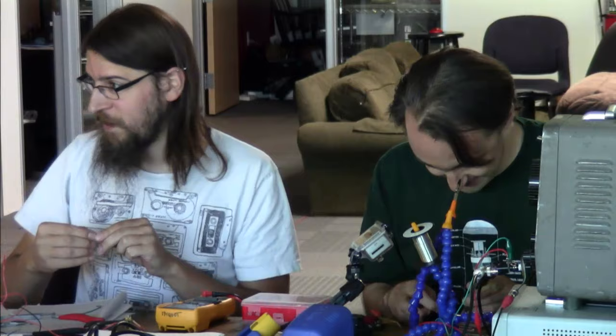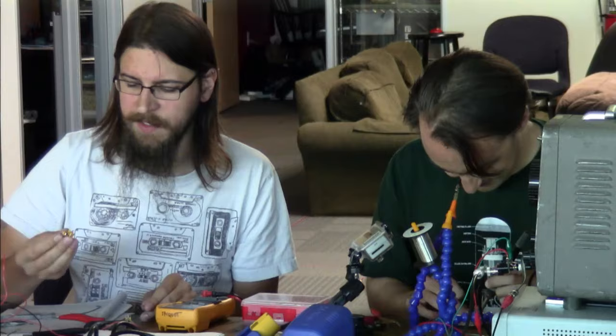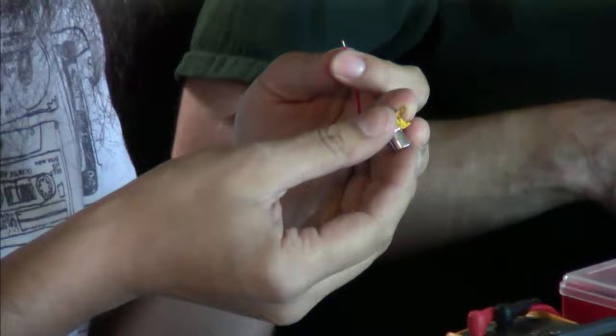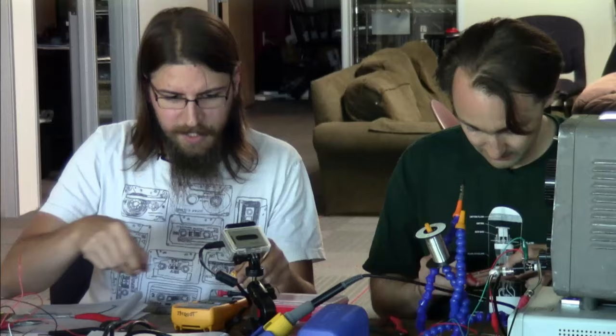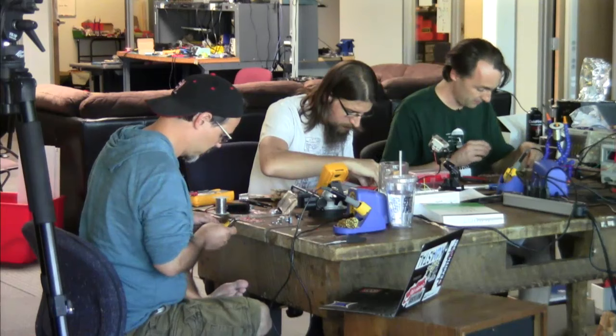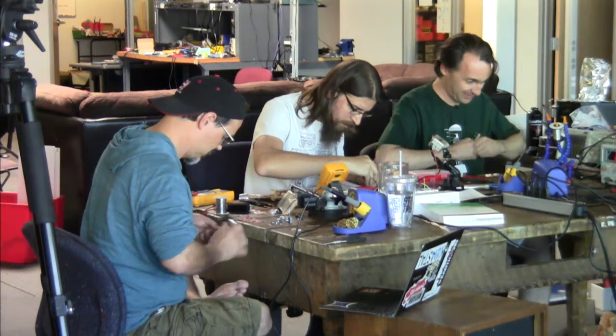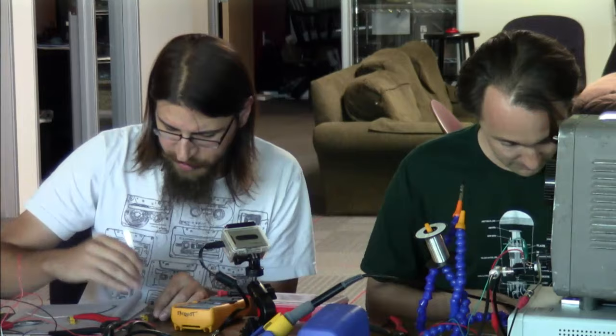That's smart. So I figured out these little audio jacks, the RCA types, they have three pins on the bottom, but I know that the RCA only has two. So I just figured out one of them is the actual connection and the other one must be some kind of a switch or a disconnect. Yeah, it's an interrupt, right? So there's three different poles on it, but it's only got two. So I used my multimeter over here to figure out what's connected to what after plugging in a test barrel that I had. I've seen that on quarter inch audio jacks as well. It detects when you plug something in.